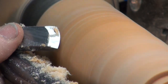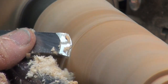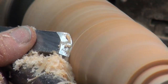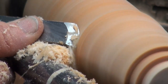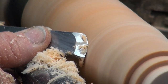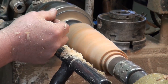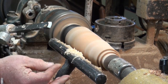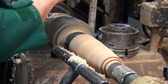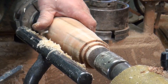I bet it's going to cut better with the long point down going in that direction. I think it just has to do with the lay of the grain of the wood in the tree. Part of the reason why they call this a skew is because of the skewed angle that we're approaching this wood at — we're not going straight in, we're at a skewed angle. I'm not an expert on a skew by any means, but there are a lot of great videos out there on skews. And it's like anything — you've still got to practice it.